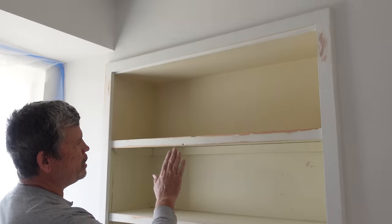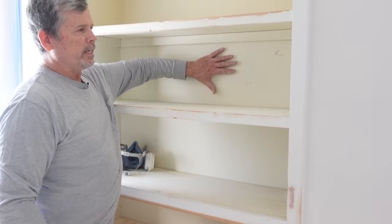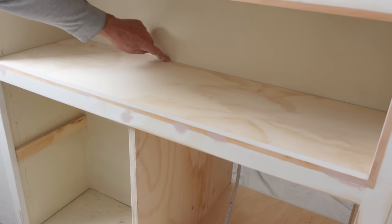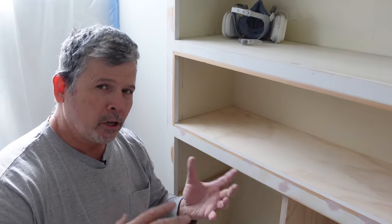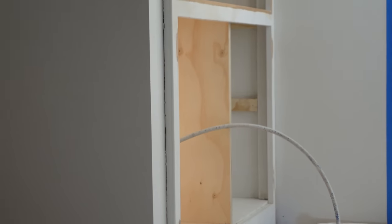We are ready to spray. It looks like a mess but it is very smooth — Jordan spent a lot of time sanding. We've got the original inside color, another color on the outside, the Bondo, and raw wood, but primer takes care of all of that. We'll caulk the seams later — after priming you can see the spots you need to caulk much better. The sprayer is set up in the hall bath with the hose pulled through. I changed shirts, got my respirator on, and we'll shoot this side then work through to the other side.